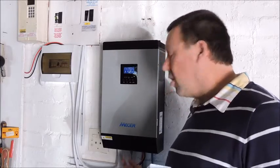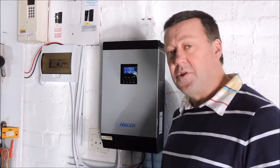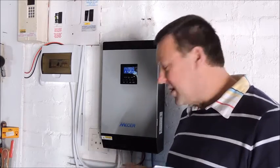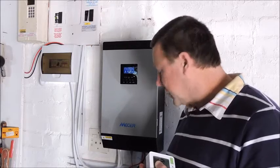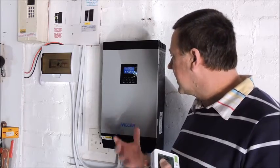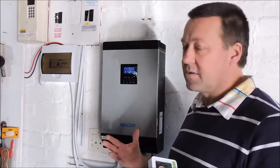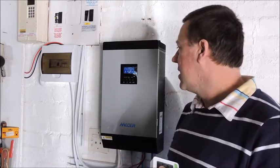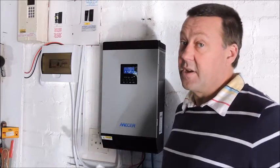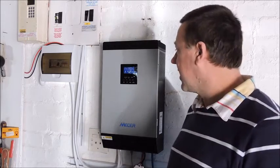This first unit had a comms port — a real pain. You had to get an old Dell machine fired up to try and get an RS232 port. The new one comes with USB. It's a shame they don't seem to have buffering, so you can't come back at the end of the day and pull stats — you have to have a machine on all the time, which in a green philosophy is not the best thing. I'm a little concerned about its quiescent drain current at night. Because the inverter is not completely efficient, especially at the low end of power consumption, you have quite a big overhead in running it. I would like to turn it off at night and save those 300–400 watts I'm drawing.